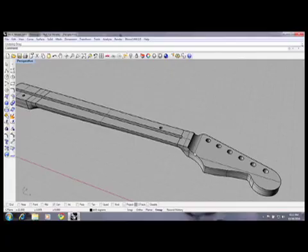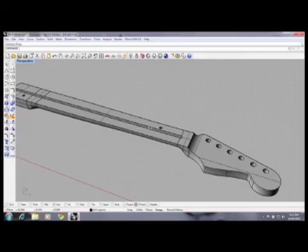This is what the solid model looks like — it was strictly derived from the geometry that we started with. This area in the headstock is actually a 3D surface; there's some curvature here that takes 3D machining. These are peg holes — that's simple 2D machining. We've also cut a slot for the stiffener down the center of the neck, and we've got some holes for alignment that will be concealed underneath the fretboard, because when we flip this over and machine the back side, we need to be able to locate it so everything lines up.